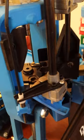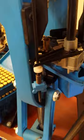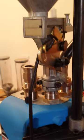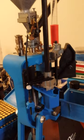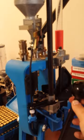This pin's real easy to pull. Put the case back in here — you can see this linkage here, it just hangs there. Now you go up: the case will go into the powder funnel, the powder drops into the funnel and goes into the brass case. Then when you go down, that rod actually comes into play — the linkage moves and pushes the powder bar back into position to receive a new charge. That's how the powder system works on the Dillon XL 650.